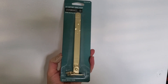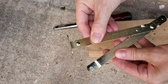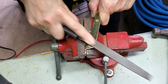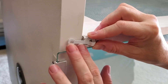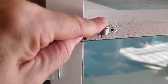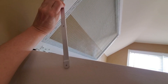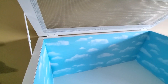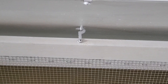The top lid needed a support hinge. Normally these go on the inside of a storage chest to hide it, but for safety reasons it needs to go on the outside. I wanted to attach the hinge to the side of the lid to prevent gaps, so I had to remove the top piece that mounts under the lid — I used a chisel and file to break the rivet holding it on. I spray-painted the latches and support hinge white to match the cage. The bottom cage lid overlaps a bit so I had to bend the latches to fit. To attach the lift hinge I opened the lid as far as I could, marked where to put it, and screwed it in. To hold the bottom lid open I added another latch that hooks underneath the top cage.